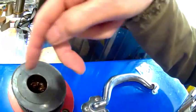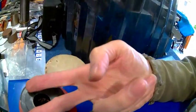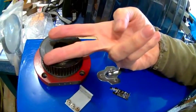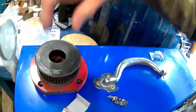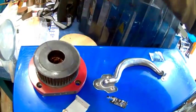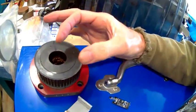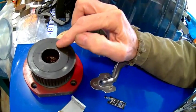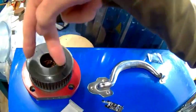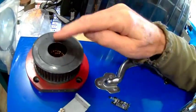The reason I've got it set on the spindle is there are two holes on the base where I can put two pins in. On the bottom of my tool holder I'll put two matching holes, and when it's loaded up the two pins will fit in, locate, and drive the collar to help reduce slippage.